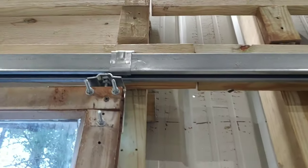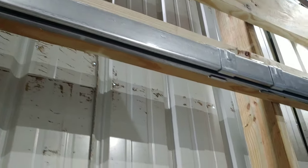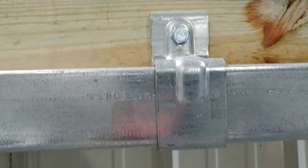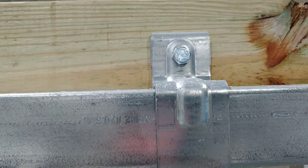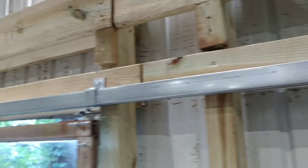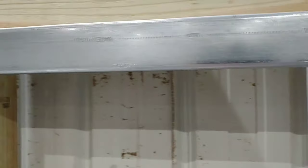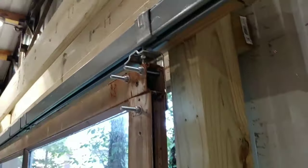Let's go back in. These rails right here — I'm on a selfie stick, I'm way higher up now. You just take these rails and bolt them up with that bracket right there. It comes with a bolt — basically like a lag bolt. I've got it bolted to a 2x6 that I have across here, and that's all it needs. So you just put that railing up, bolt it on with those little clips, and hook up the door.